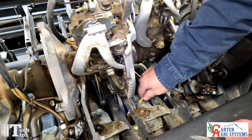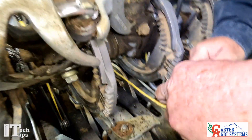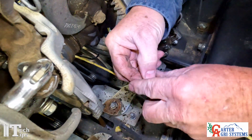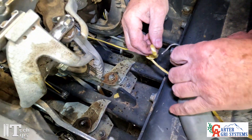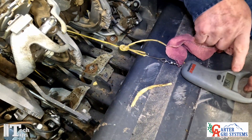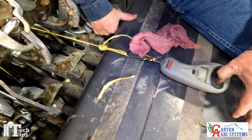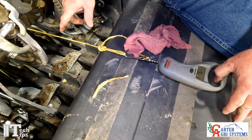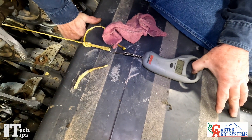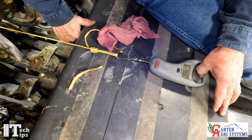Now that we're on the back side of the knotters, you're going to take your twine from your twine tensioner and pull it through. Take a loop, put it in here, and take your fish scale. On the top we want to have 15 pounds of pull. As we pull on this, we don't want that roller to turn on us until we reach 15 pounds. You can see we're breaking it at about 10 to 11 pounds.